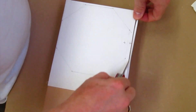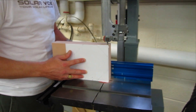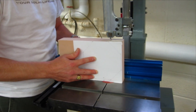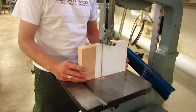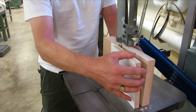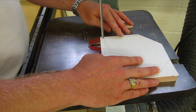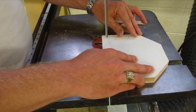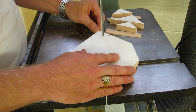I'm trimming off the excess paper and just setting the depth. I'm going to take that over to the band saw and cut a little slab to the thickness that I want — that's going to get me my blank. The basic part is just cut out on the outside of the lines. Then I'm going to take it over to the sander and sand to the lines to get the part exactly to the size that I want.